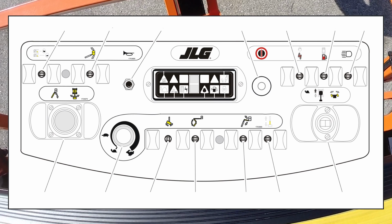Steering is by the thumb activated rocker switch on the top of the handle. Push on the left side of the switch to steer left, on the right side to steer right. The drive controller is spring loaded and will return automatically to the neutral off position when released.